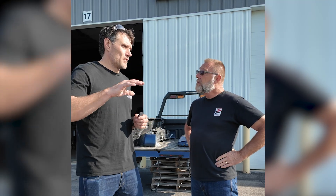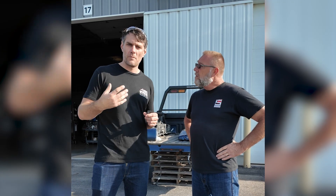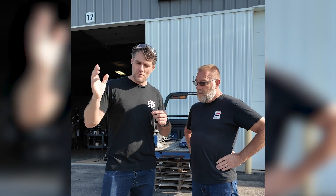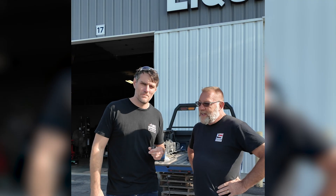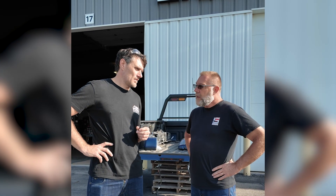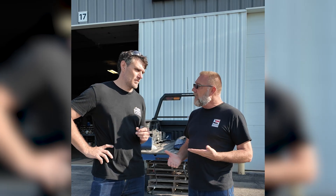They serve the ambulance sector, the RV sector, and now the pickup truck market which is still fairly new. There have been some recent refinements — the hybrid kit now gives a constant ride frequency using a small nitrogen vessel. That means it rides the same whether you have a full GVM load or are empty — very smooth ride both loaded and unloaded.